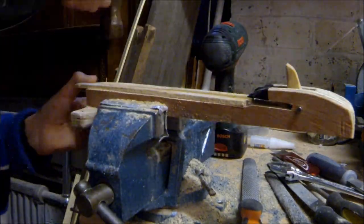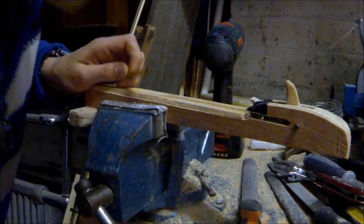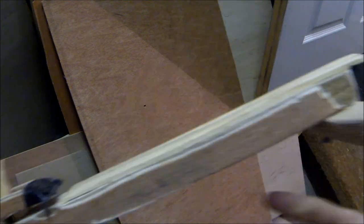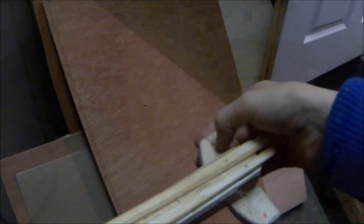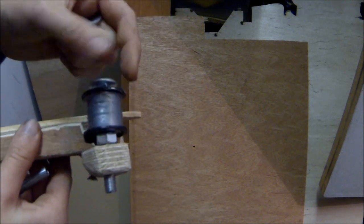It's very important that these are made properly and are aiming straight down the barrel of the crossbow, otherwise it won't be accurate. This is what it looks like once I've attached the bolt guides and rounded the edges. I've put two dots half a centimeter in on the edge of the 18 millimeter multiplex plywood where I'm going to drill holes.